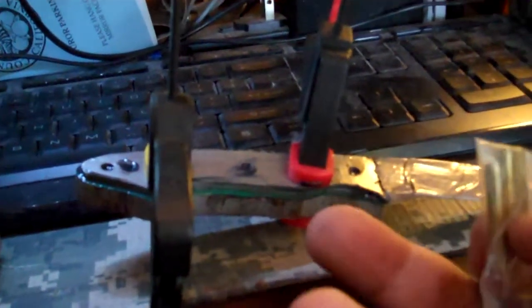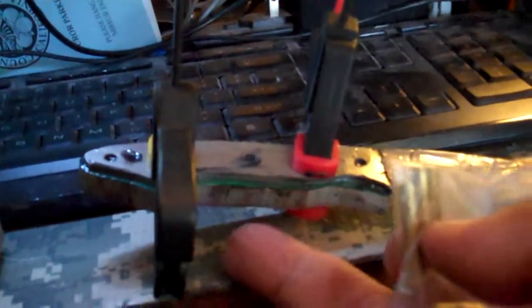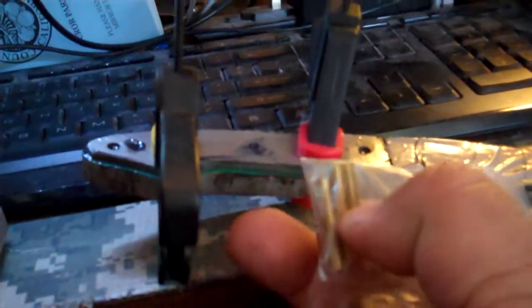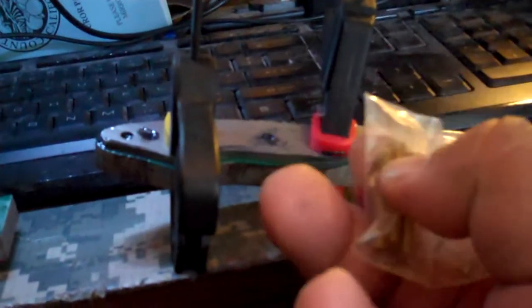And then I can drill out from the other side, from this side where the hole is still, drill it out that way to expose the other holes on this side in the material. And then I'll put the pins in, epoxy them in, and then peen over the edges, and then I'll sand up the material edges, and sand down the rest of what's left of the pin.